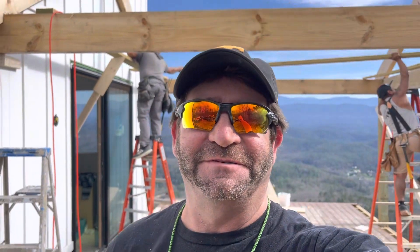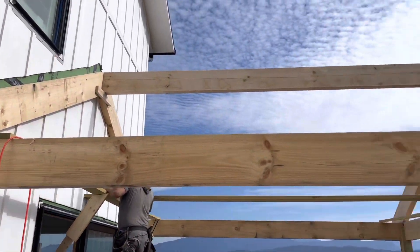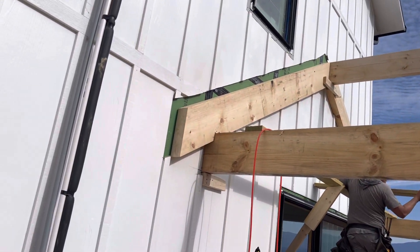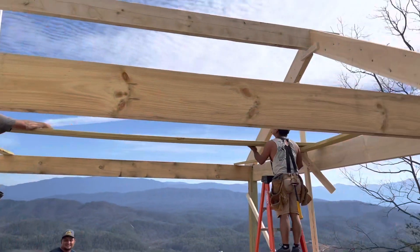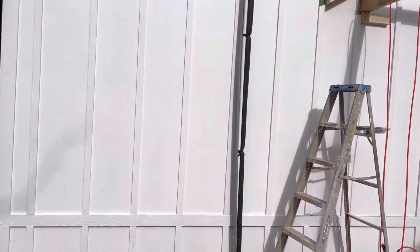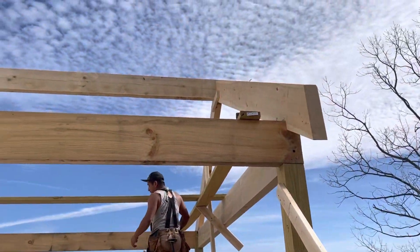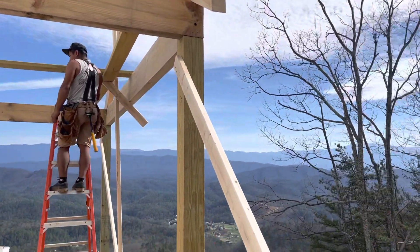This is John Hood, Pearl Harbor Extraction. We're building a timber roof over this deck — I'll just show you what it looks like. We have 4x12s for rafters. We had to cut the wall out there to attach this to it, and it's built right on the deck. We're going to be using 2x6s on top, so you'll see the tongue and groove on top of the roof. And it'll have a metal roof. So that's how we build these.